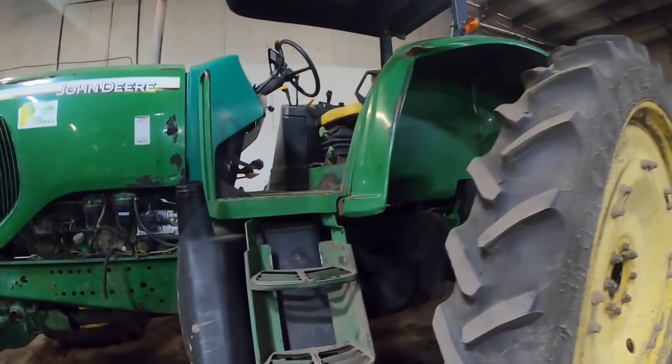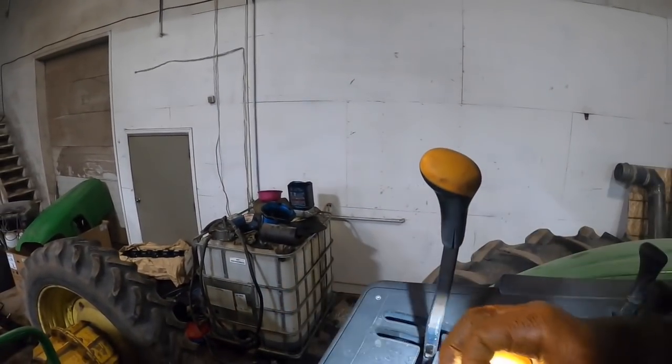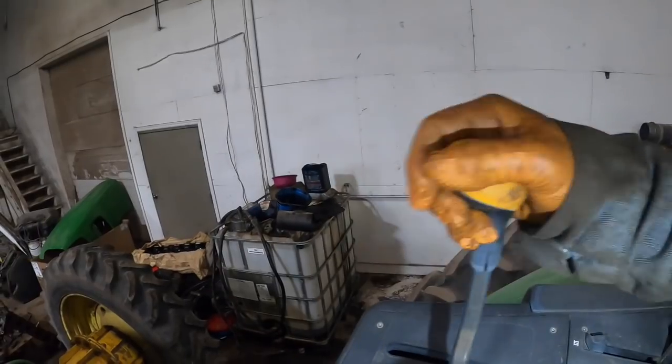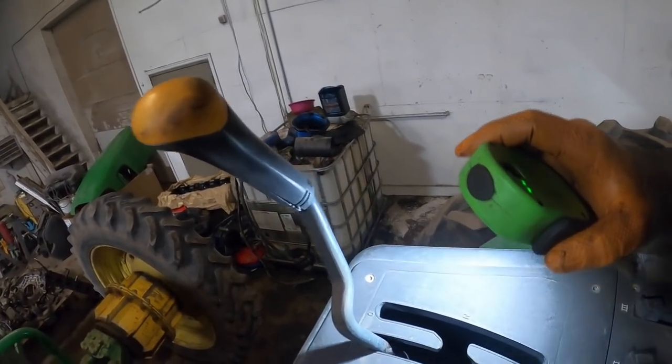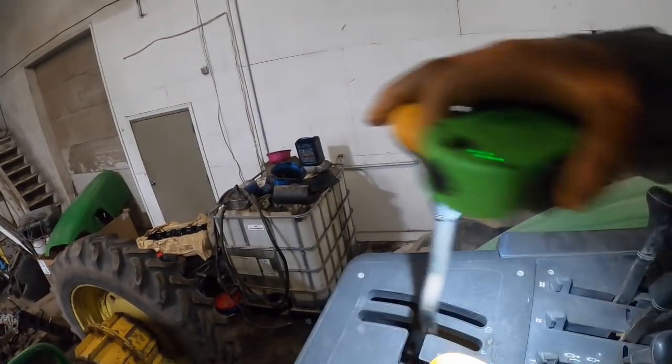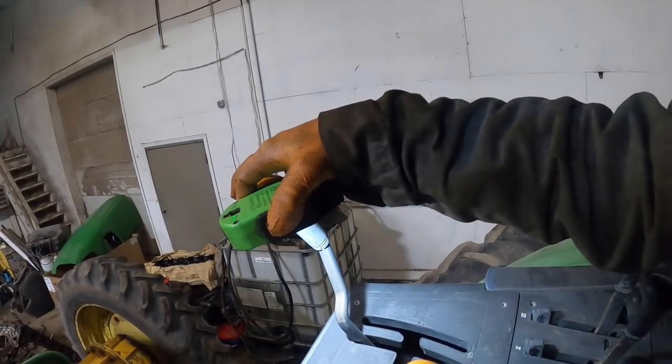The other thing is something going on — I don't know if they screwed up the linkage, but it will not go in any of the gears. It only has one gear. The power-quad part is working but the range part isn't. What's going on here — that's just moving back and forth. They must have broke a cable. So it's only got one gear, it's stuck in range. I'm guessing they broke the cable.